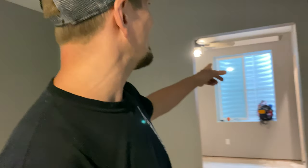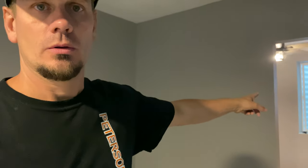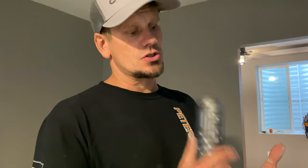Make sure that when you're calling a room a bedroom, you have an egressible window. That code has really changed so firefighters can get out with their air tank on. Otherwise, you cannot call it a bedroom. It has to have a closet, a smoke detector, an arc-fault breaker, and an egressible window — those four things. Thanks guys for joining us, have a great week.